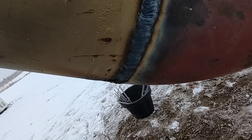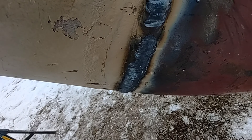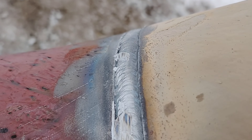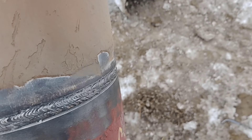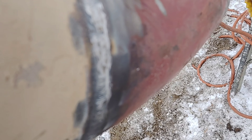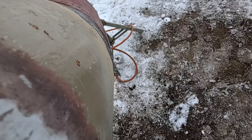This ain't even the prettiest yet. I'm actually a little rough there, super rough — I haven't run this low-high in a minute. But I think it'll be enough to get a nice good cap on there. If it's kind of lumpy in some spots, just take your grinder and take it down — there's no shame in that. Make sure you get a good slick appearance. See how flush that is? I took down a couple spots on that low-high side. Get it flush, get it where you like it. Get it flat all the way around so when you're running that cap you know you're flush with the pipe.